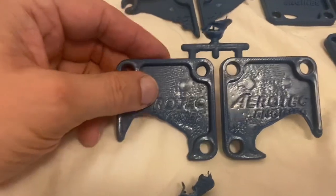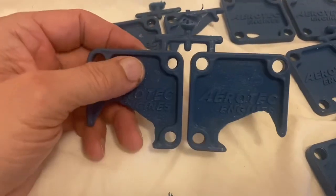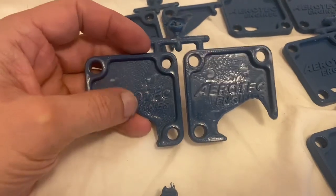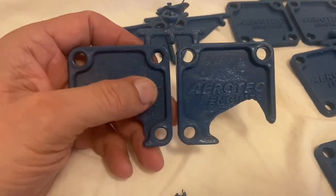You can see this one here too — this is typical. I would get the outer piece injected and then get a failure in here. If I don't have 60 degrees on my mold and it hasn't sat there for at least 10 minutes at 60 degrees so everything's equalized, then I don't even start shooting.